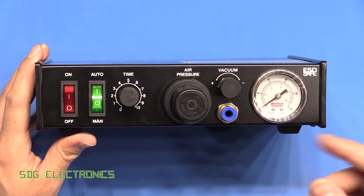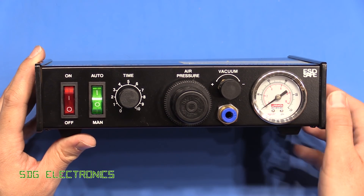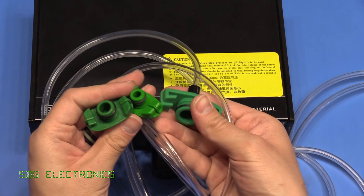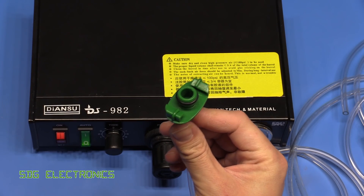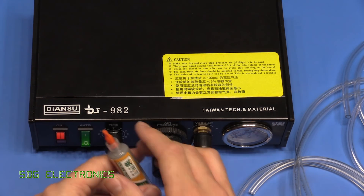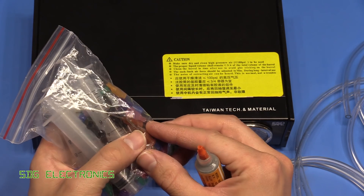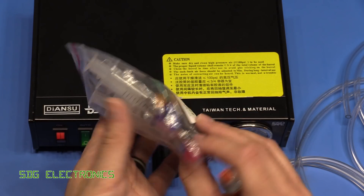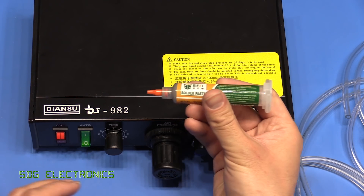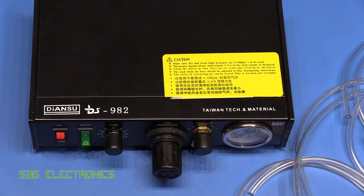The idea with these is that you connect up your foot pedal and a compressed air supply, and then you plug in your syringe adapter to the connector at the front. This one came with three different size adapters — the most common size lets you take the cap off the syringe, plug it in, and twist it around. Then you take off the luer lock connector and put one of these little dispensing needles onto it — I think I bought them from eBay for a couple of pounds. Then you can go around your PCB, put little blobs of solder paste on it, and reflow it with a hot air gun or a reflow oven.